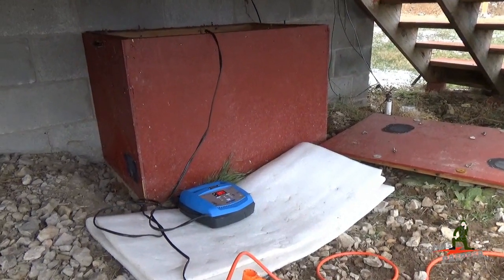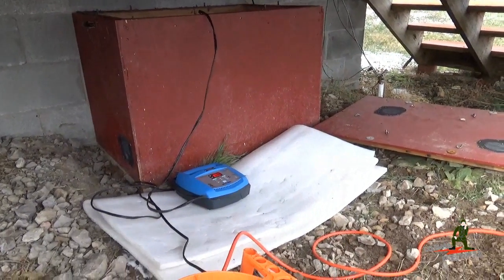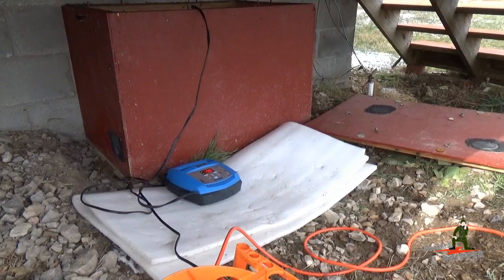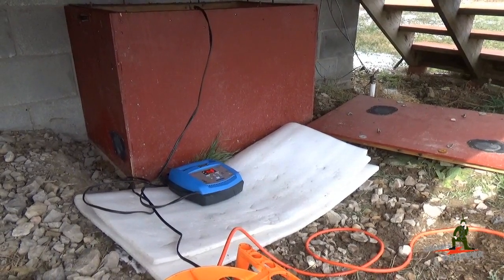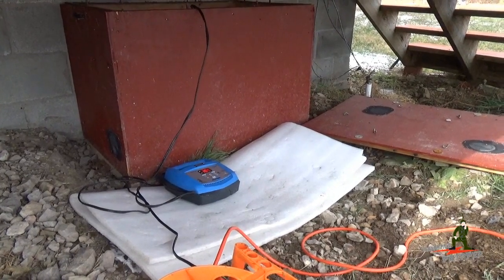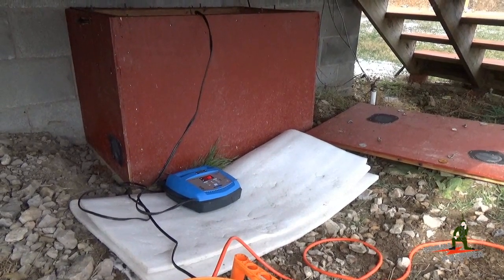So that's what I'm doing here. We got the battery charger hooked up, topping off the batteries, and I'll button everything up and normalize the system. Now before I put this battery charger on the system, I do disconnect the inverter and the charge controller so we only have the batteries — everything else is isolated. We've had the charger on here for about an hour and we just hit 100% charge.